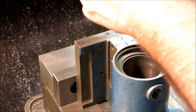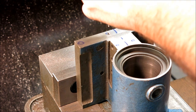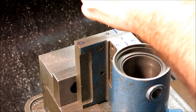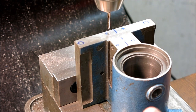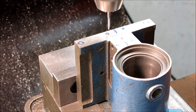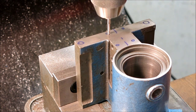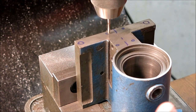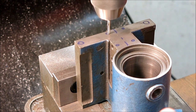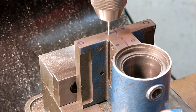I think I'm loosening the collet. There we go. So now the collet's still grabbing it a little bit, okay? But I can turn this, so I can use this like a tap guide now and kind of have a sensitive feel. Actually, I'm gonna loosen it a little more. So I'm just using two fingers on this now. So I got a pretty good sense of feel on this. So I'm all nice and straight and I'm nice and short and everything, and everything's feeling pretty good there.